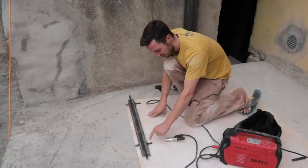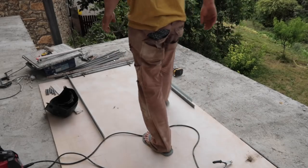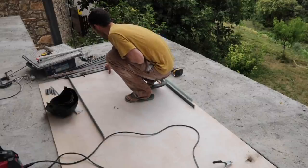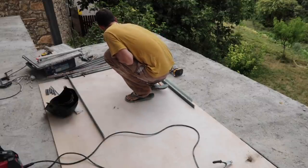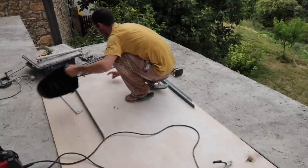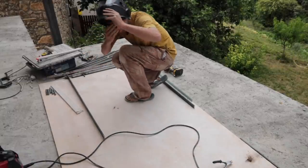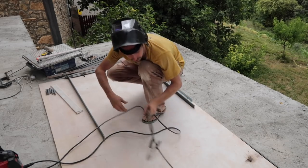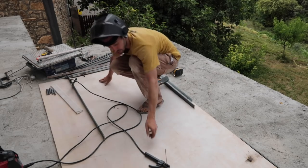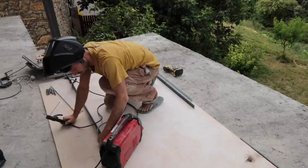The bar's a bit thicker, which means I can mount the metal bar and bring it up into the thinner metal. With my freshly made jig, I've got a long clamp to give me the accurate height, and now it's time to weld. It should be relatively straightforward since it's thicker than the cross beams in the balcony, but I've never done it before so I'll just give it a try.